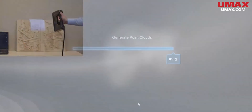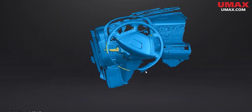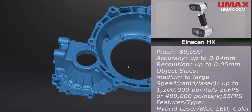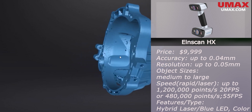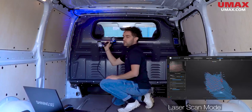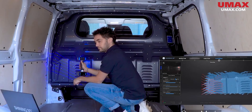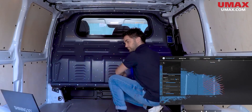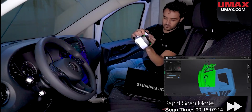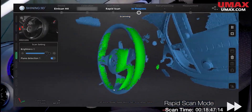The Pro HD can be thought of as the 2X's higher performance counterpart. However, both are worthy of applications such as engineering design and manufacturing and many others. The HX trades fixed scanning capabilities for laser scanning — the highest performance variety of handheld scanning. The HX also still has a structured light scanning mode with built-in color scanning, making it a hybrid scanner. It's a great choice for very high performance scanning, just shy of metrology level. Laser scanning is powerful and great at scanning difficult materials such as reflective and black surfaces, though it does not capture color texture and requires the use of markers for tracking — which is why the HX's hybrid nature is so useful.